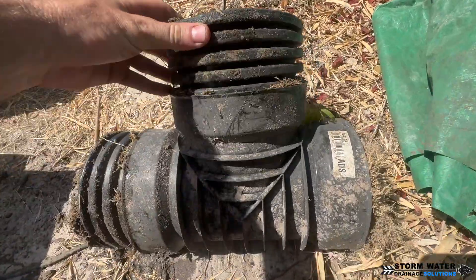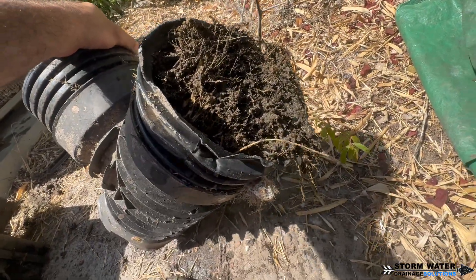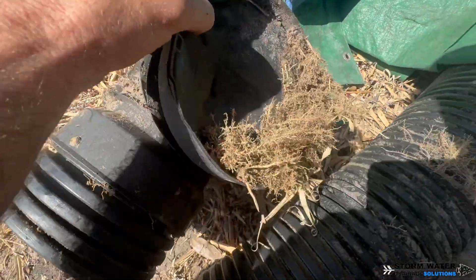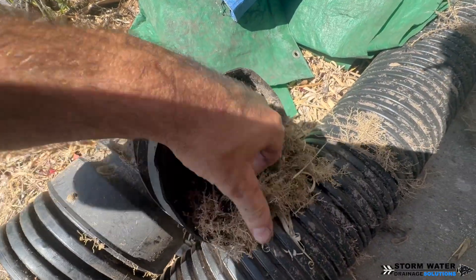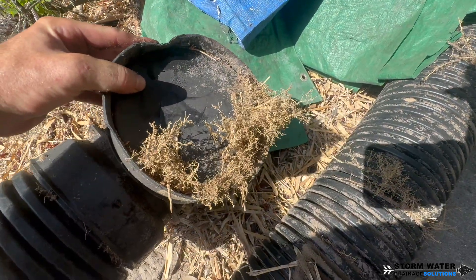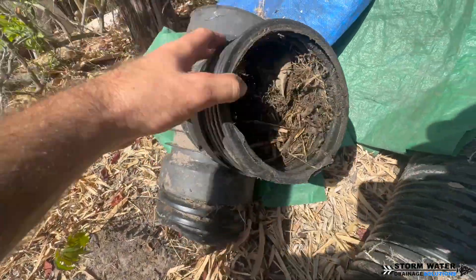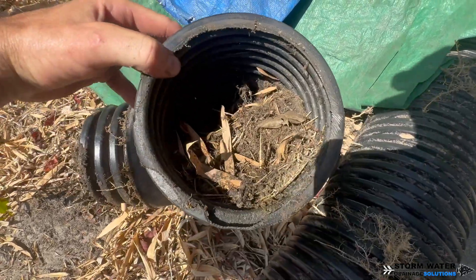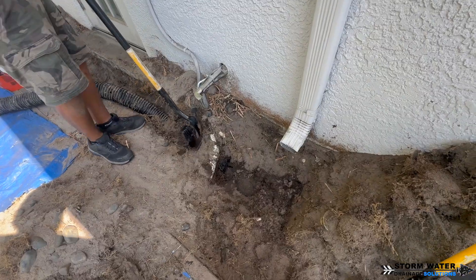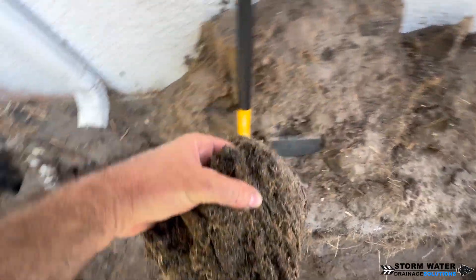Take a look at this — it's called a blind inlet tee. This blind inlet tee is meant to act as both a tee fitting or a 90-degree elbow for six-inch pipe. The problem with using it for a 90-degree elbow is debris will actually circulate backwards into the tee fitting where the cap is, creating that 90. You can see all the root intrusion here because this cap is not sealed, so roots can easily grow in there as well. There was no tile tape used on this system either, so we had massive root intrusion at all the joints — that was another failure point. We would never use a blind inlet tee for a 90-degree elbow; we only use them as a clean-out tee fitting. I'll link a video in the description below that explains these blind inlet tees in more depth.